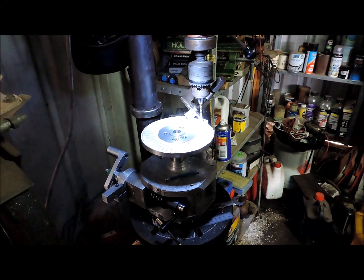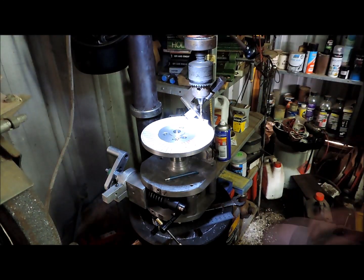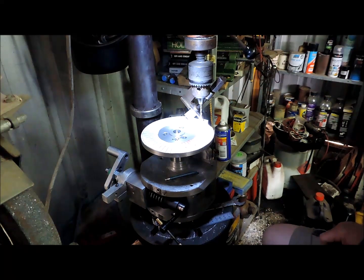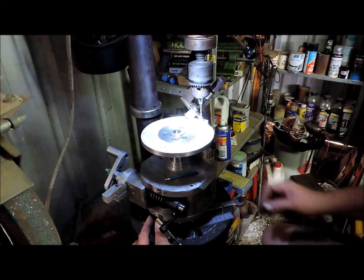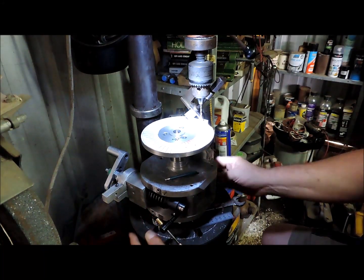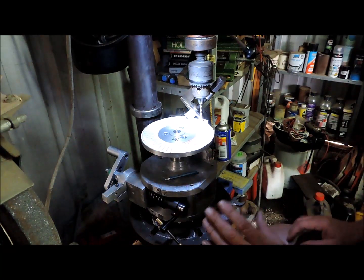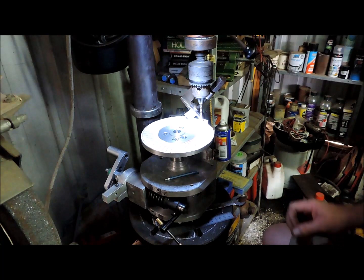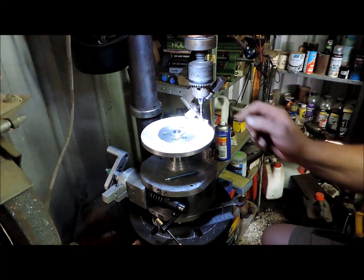I have the modified Gingery dividing head mounted to my drill press. T-bolts have bolted it down to the drill press. The drill press is locked for height, sideways swing and rotation of the table. The position of the drill for the first row of holes is now set.